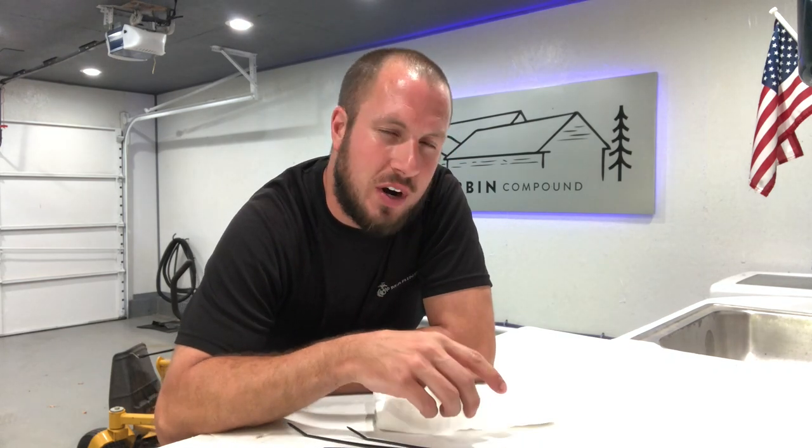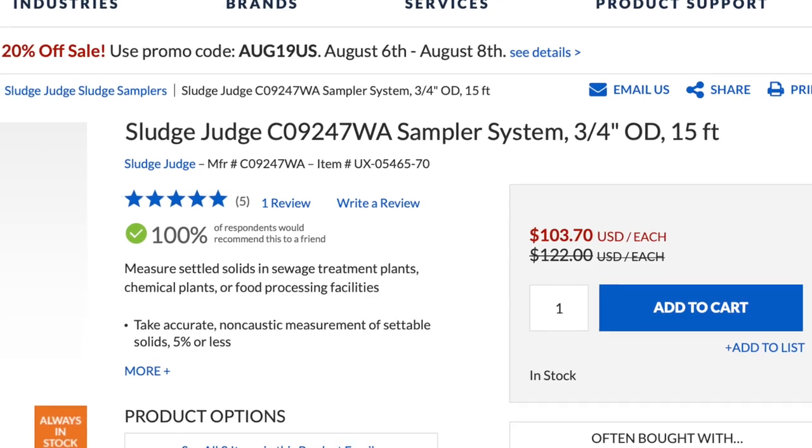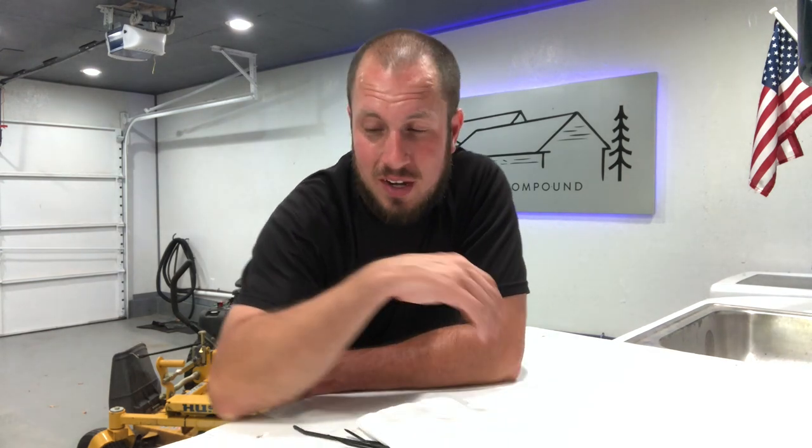Alright guys, now we're going to make a sludge stick. This is an extremely cheap option if you don't want to buy one of the expensive core sticks or sludge pros — I've seen some that are like $75. I'm using a cheap option with some cheesecloth wrapped around a piece of IMC conduit. I've got a 10-foot stick. The cheesecloth will stain from the sludge on the bottom, and up the shaft we'll see where our water line is, then measure to make sure we're under 25%.